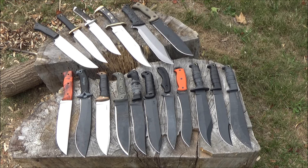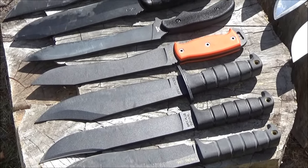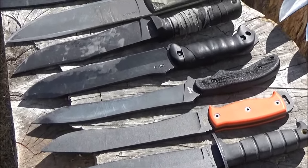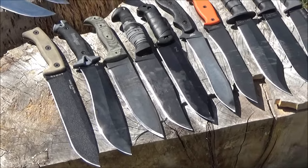Lastly, let's just touch on steel selection. I prefer high-carbon steels such as 1095 for large fixed blades because they offer a combination of ease of resharpening and what they call toughness. Condor's 1075 is also pretty good, and 5160 is a staple. Now these require some care — carbon steels, you've got to dry them off, oil them to protect them if necessary. You could write 10 books on steel, but my short answer: I prefer high-carbon. And some more flybys for you — big steel is beautiful. People could write whole books on these. You could write whole books on just selecting a sheath and it still wouldn't cover it. So we just barely even covered the surface.